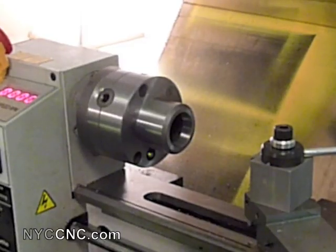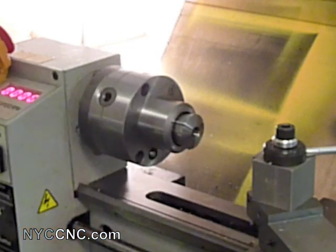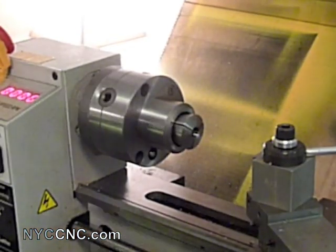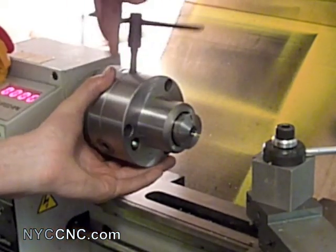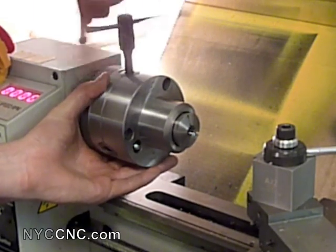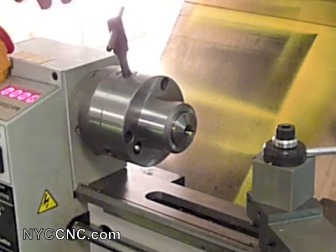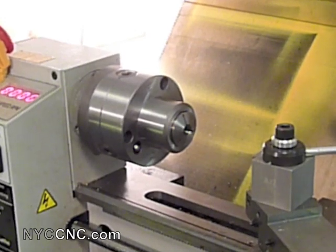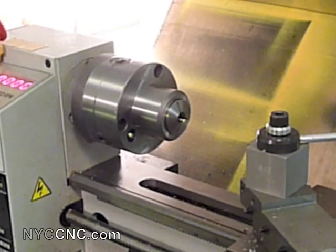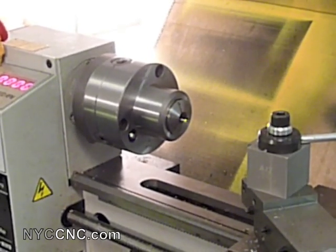To put a collet in, you line up the groove with the groove inside the chuck, which you can do by feeling. Once you're all the way in, you can start to spin the chuck. I like to hold the collet to feel to make sure I'm spinning it. It takes about 30 or 40 rotations to get back, and once I'm there I'll actually insert the stock material and snug it down. This isn't a perfect setup right now because I've got a few tolerance plays — usually about 3 thou or so. In some instances I'm still more accurate with an independently adjustable four-jaw, but if you're paying attention to how you use this, it can be quite accurate. And obviously the convenience of being able to chuck up a specific size is great. I actually tend to leave this chuck on my lathe most of the time. That's it, folks. Thanks.